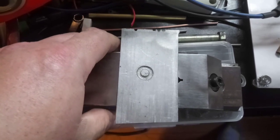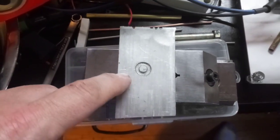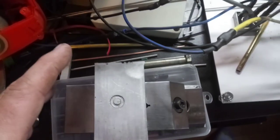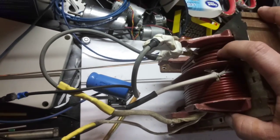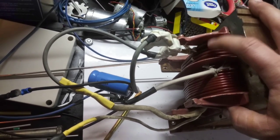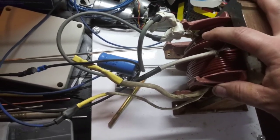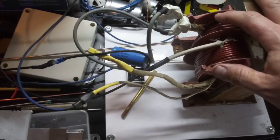As you can see in one of the videos I'm going to post, the voltage on the voltmeter was about 160 — I think that's too much. This transformer is out of an arc welder; this is the primary, this is the secondary, about 40-ish volts. You can tell by the diameter of that copper it's got some good amperage. I'm thinking lower voltage, higher current might be better for maintaining an arc, but again this is all trial and error.